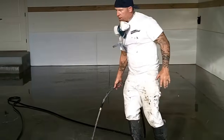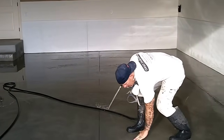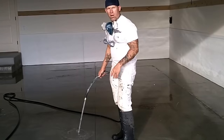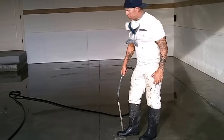One way to make sure my floor is rough enough is to take my shoes and rub on it, or take your hand and it should feel about like 100-grit sandpaper. Not too rough like 80-grit, but about 100-grit would feel about right. If it feels like 100-grit sandpaper, then it's rough enough that the epoxy will bond to it.